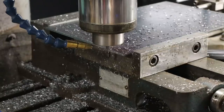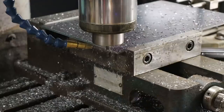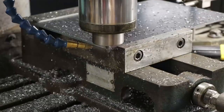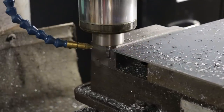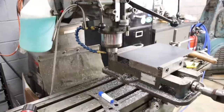And obviously I'm running way up high on the end mill for rigidity, just a small end mill, but you know, 9 times out of 10 the most upper part of an end mill doesn't get used. And even if you've got an old box of dull ones, they're good for stuff like this. But you get the idea, just cutting these plates down to length, using my repeatable setup, and that's how I'm gonna do every piece on this box.